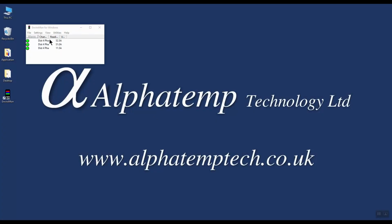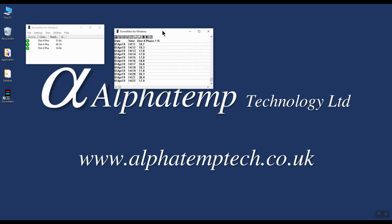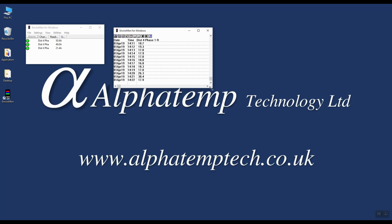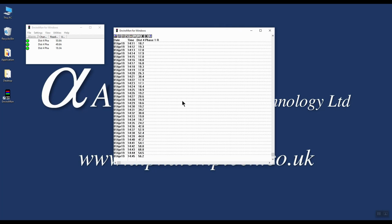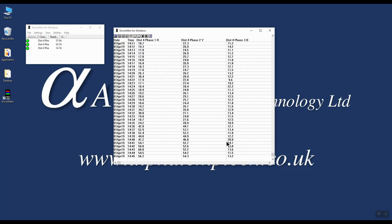To access the spreadsheet, we need to select View and then Spreadsheet. We can now move and resize the window. As you can see, we have one trace showing. To view all 3 traces, we need to select the multicolored button at the top. Once you select that, you can now see all 3 traces there. You need to ensure that all checkboxes are ticked and then click on OK. And as you can see, you can now view all 3 traces.